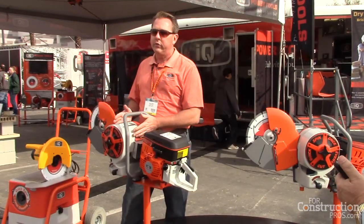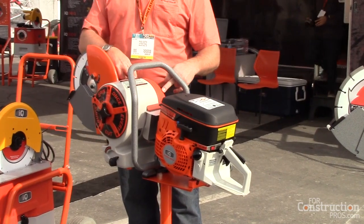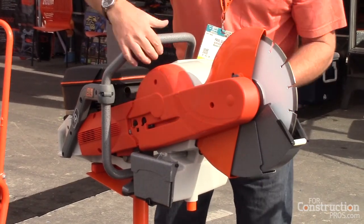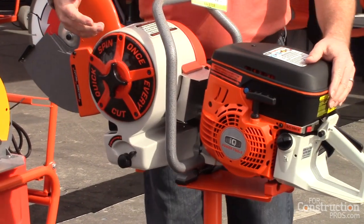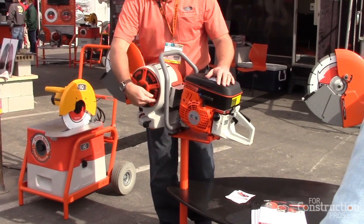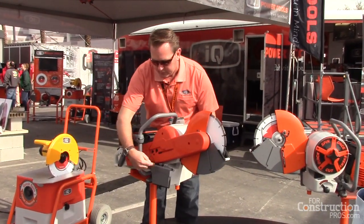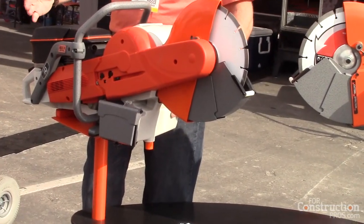This is the world's first power cutter with fully integrated dust collection. How it works is there's a vacuum fan powered off of the motor. You make your cut and the dust coming off the blade gets sucked in right into here, and gets captured on a filter right inside. About every 25 to 30 cuts, to clean the filter just spin that — that cleans the filter and drops the dust down into here. Once you do that about five times and you get about five pounds of dust in the lower area, you just unlatch the latch on this side, pull this lever, take it over to the bucket, and dump out that dust. That way you get that weight off the saw and continue cutting.